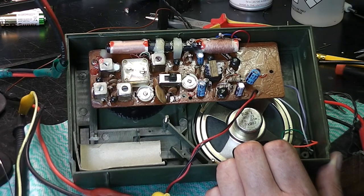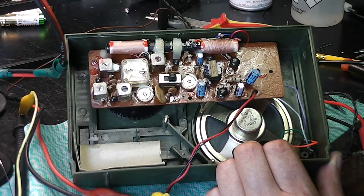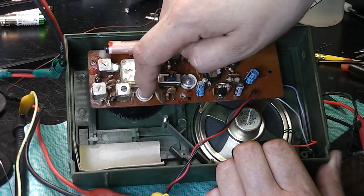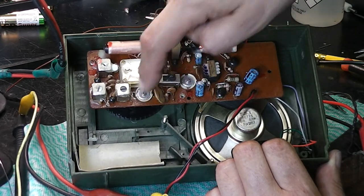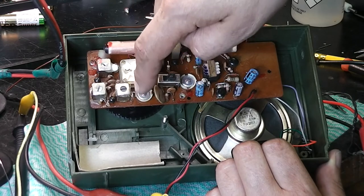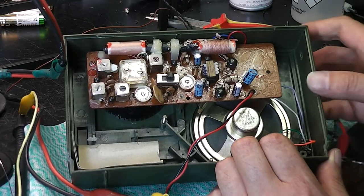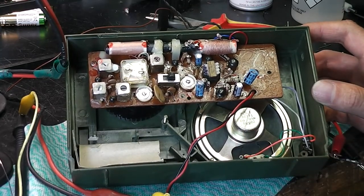If I'm going on the convention of how it's done in a valve radio, I assume that the coil will track at the bottom and this variable capacitor will track at the top, so it'll be a bit of tracking each end, high end and low end, until I get them to line up again. I'm assuming these might be for long wave, I'm just not sure. They seem sensitive still. So yeah, I think that's what I'm going to have to do. It'll be a bit boring.